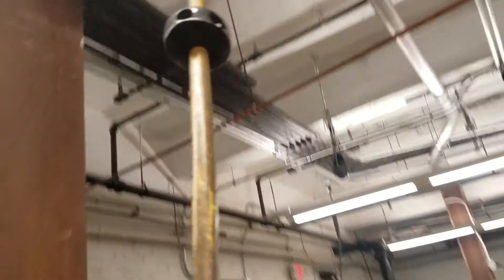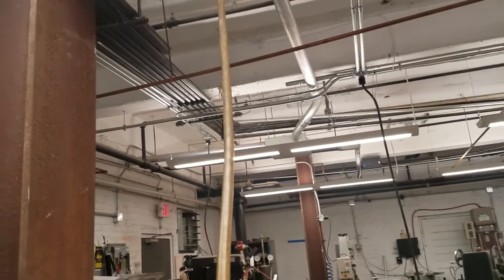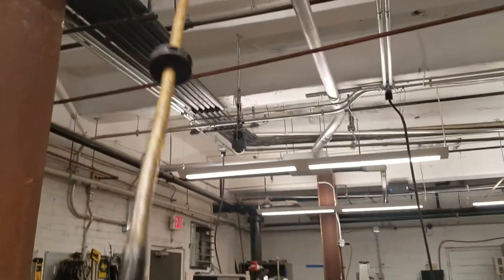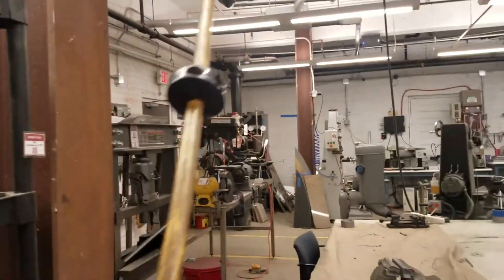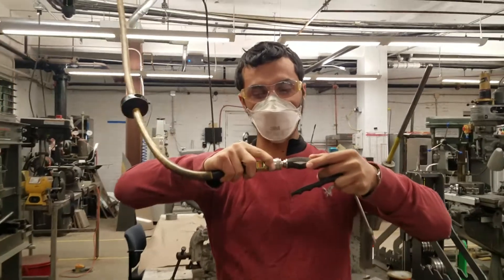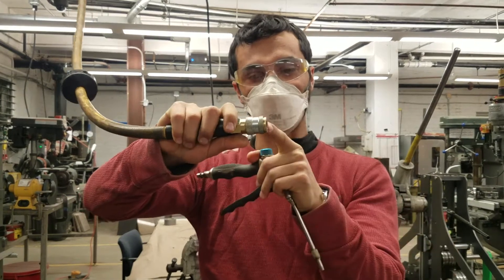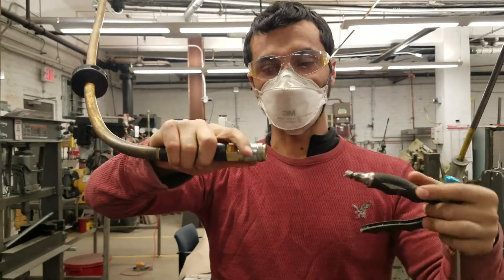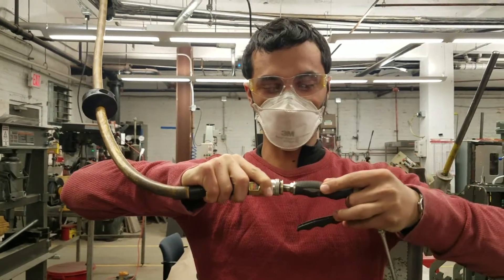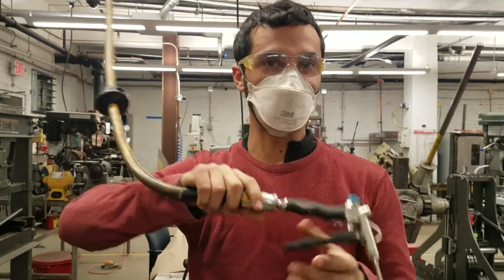For the pneumatic airline, you pull it out and stop pulling when it's clicking. To disconnect a tool from the hose, push in on the implement, pull back the collar, and the tool will come off. This one is auto-retracting, but it still doesn't hurt to pull back on the collar. To reconnect, push the tool in hard — you have to push quite hard to overcome the air pressure — then release, and the implement is reconnected.